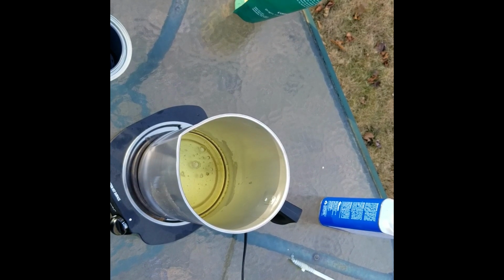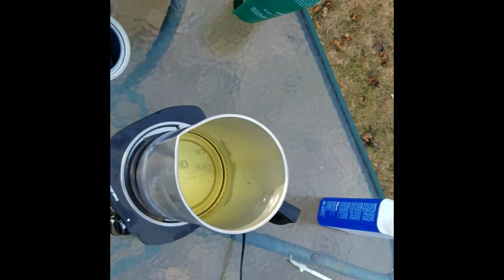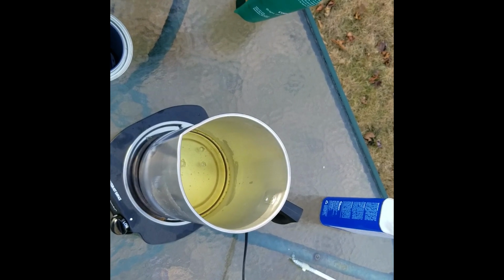All right everybody, the wax is melted. You can hear some popping because there was a little bit of moisture in there, so just be careful if that happens while you're looking over the top of it. I'm going to go ahead and add the linseed oil next. So 1 part of linseed oil to match the 2 parts that you put in of the wax.